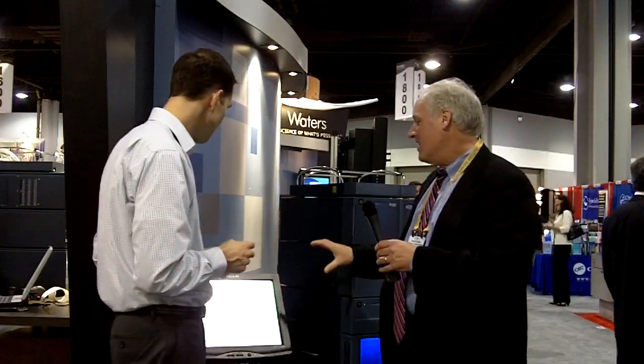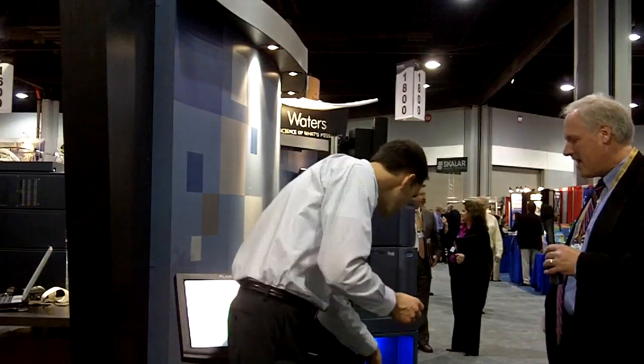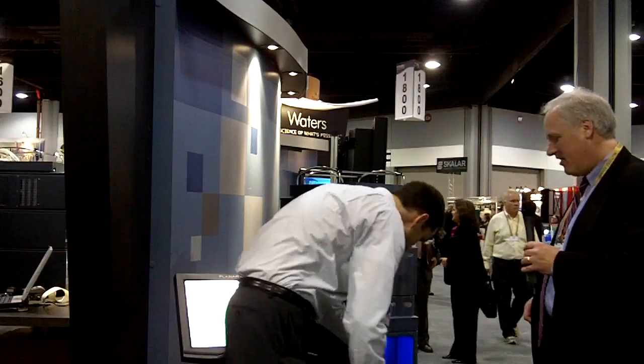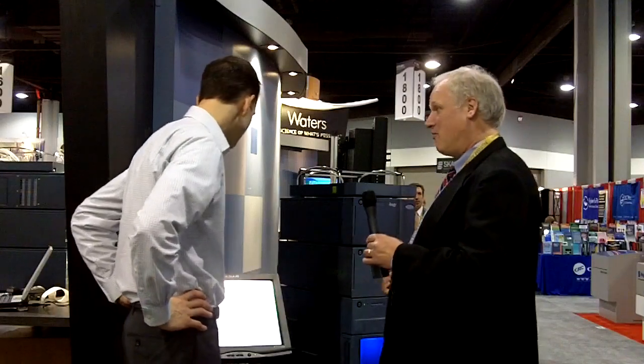There's also the at-line functionality in which we utilize barcoded vials to perform the analysis. It's very easy and straightforward — let me give you a vial and you can do an analysis. All you do is come up to this touch screen and touch the big green button to load your sample, then come over to the instrument and slide the port back, insert your sample right into that port, and lower it. The system will check to ensure that the vial has a cap and a septa on it, then read the barcode to ensure that it's the right sample being introduced to the right instrument at the right time. It will then add that sample to a queue and, from that barcode, load the appropriate method, choose the appropriate column, and choose the appropriate analysis method — sending those results directly to a user by email.